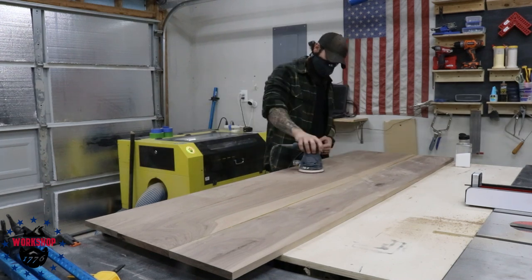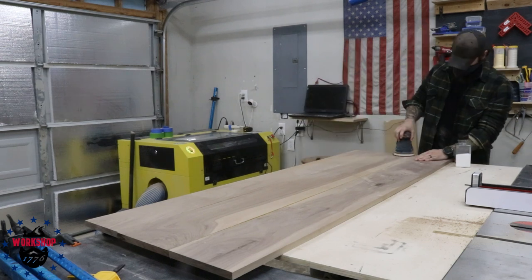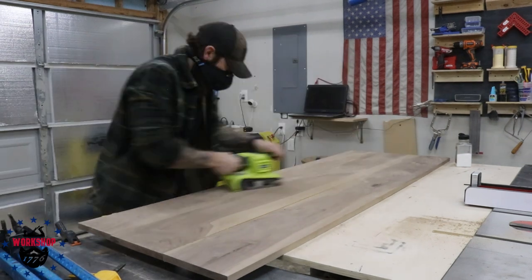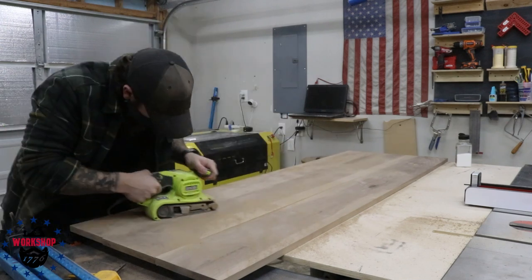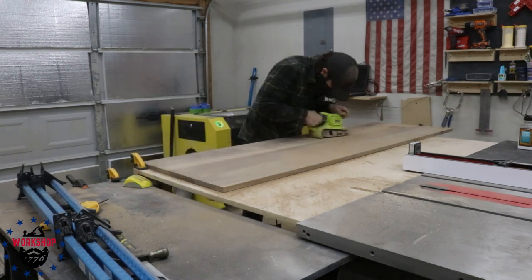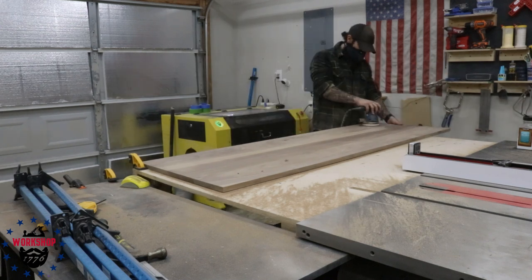I started addressing that eighth-inch slippage and thought maybe I could use my random orbit sander with 80 grit, but that was taking way too long. I'd flattened stuff with a belt sander before using 36 grit then 80 grit, and it left some deep grooves. I thought maybe it wouldn't damage walnut as bad since it's a hardwood. I was wrong. There were really deep gouges, and running through the grits got most of them out but it was incredibly time-consuming and they're not completely gone.